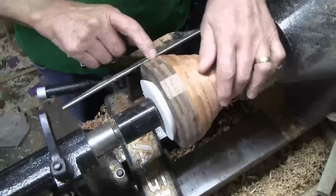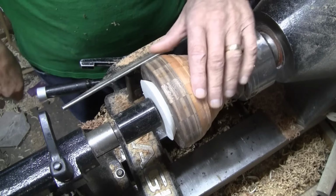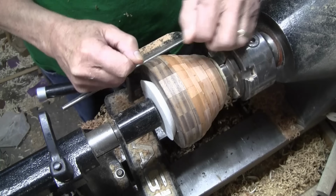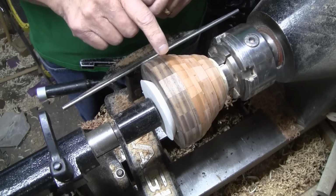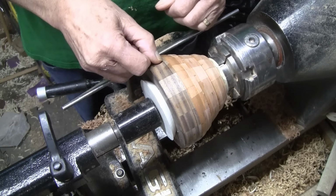Okay, I let this sit all night, and just looking at the grain in here, I just lightly cleaned it up. It is a beautiful piece of walnut, but I don't need a ring this wide. I need one about an 1/8 inch wide. So I glued it together out of a bigger piece because I need 2 of them at an 1/8. It's just easier to glue something this wide than an 1/8 inch wide.